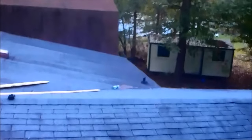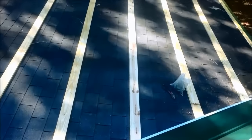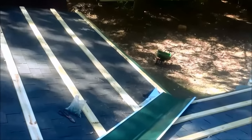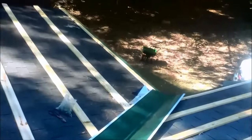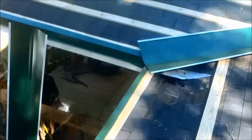I finished all my wood pieces. Next goes the valley, and you want to use minimal screws just to hold it in place, because once you're screwing your sheet metal, the roofing panels will overlap that. Less is more — fewer holes to leak. I put my drip edge on and cut it to overlap at the corner.